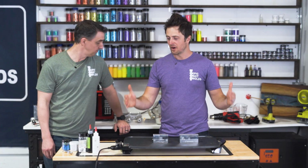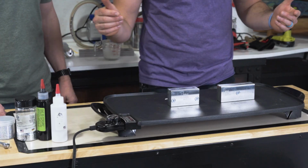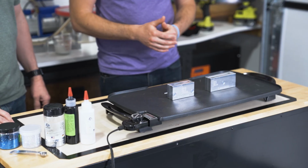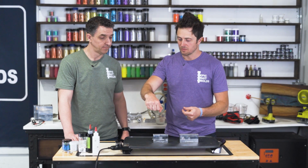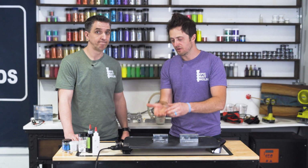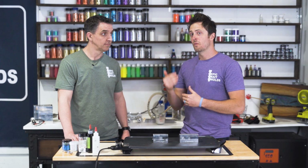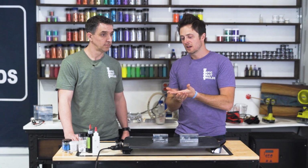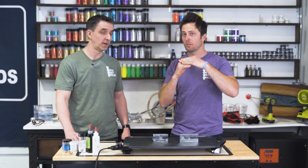We also here have our griddle. You don't necessarily need a griddle to do this, but we have this griddle at about 275, 300 degrees. We're heating these molds up there, hot to the touch. And that is so that you don't get what's called cold cracking. Right. Cold cracking is where, as you're pouring your plastic in, even though it's hot, the aluminum sucks a lot of heat out. So as it's filling up, it's kind of folding over itself and making these lines in the side of the bait. And when we do our 2-color bait in a minute here, when we pour the first color and then the second, if the mold is cold, you'll get a hard line between the layers and they might actually delaminate. Right, they'll pull apart.